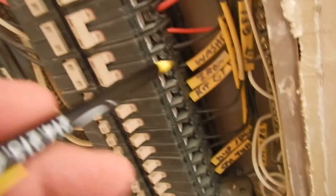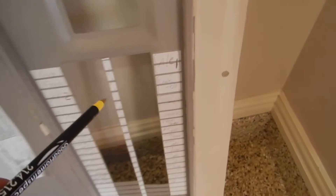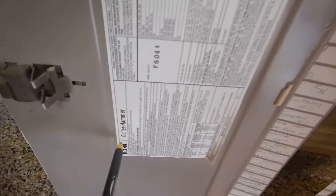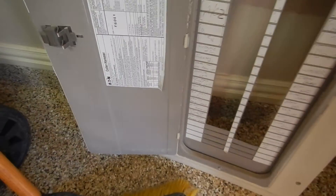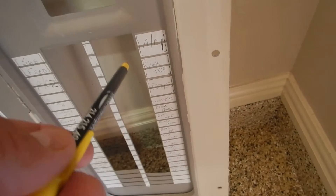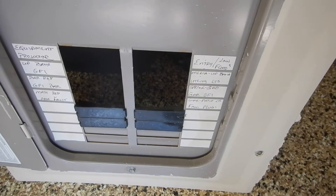To summarize: we've got debris, paint, white hots not properly wrapped, screws instead of nails, a cabinet gap more than an eighth of an inch, bundling, no protective covers for L1 and L2, and bonding locations not properly wrapped with tape. Also, the circuit labeling is handwritten — the code and the manufacturer require it to be printed, as seen where it says Cutler-Hammer on the panel.